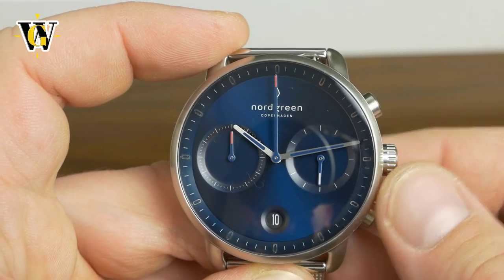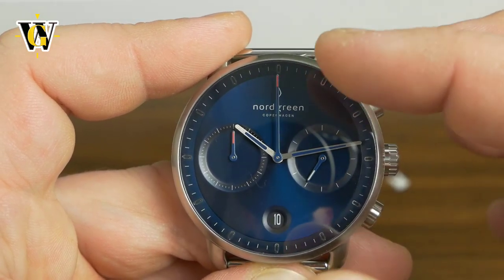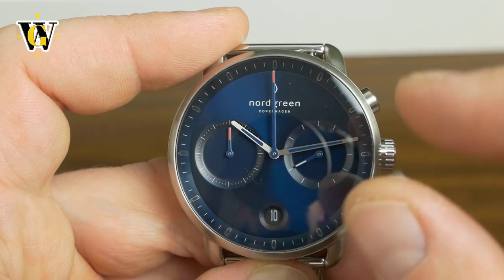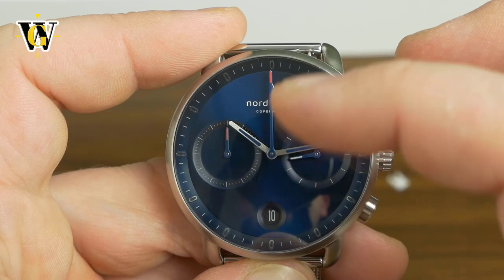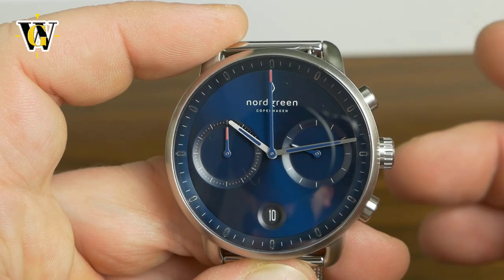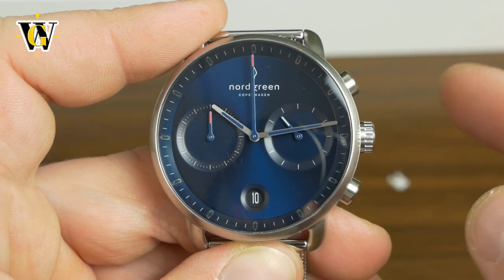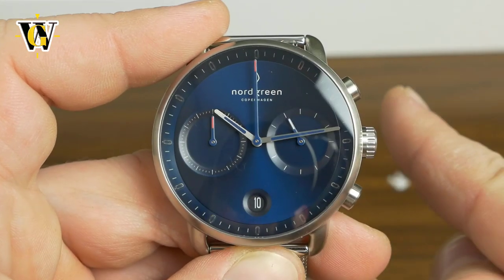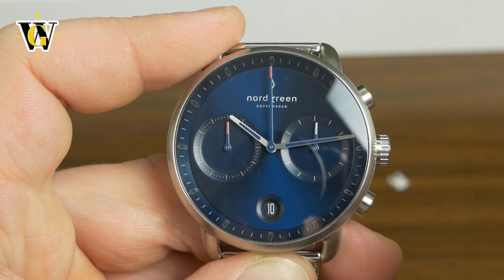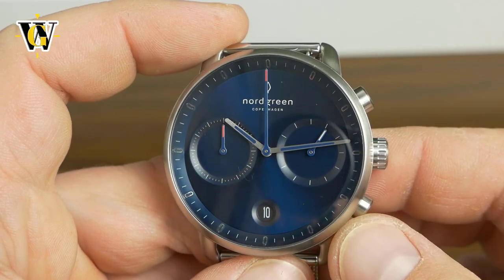This is probably more reliable because on Citizen or Miyota movements — and on chronographs that are completely quartz powered and moved with little motors — you can always correct these hands if they get misaligned. When you have something like a mechanical chronograph or the Seiko mechaquartz, when you press the reset it's a pretty violent motion, so if the seconds hand gets misaligned you cannot correct it using these buttons — you have to open the watch and reinstall the hand. So this has a certain advantage over that when it comes to reliability.